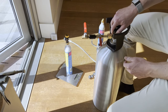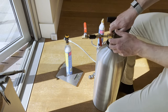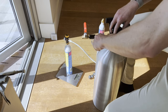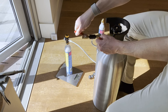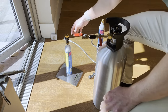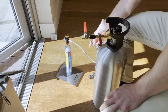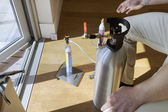To start the filling process we first need to vent any gas out of the hose. To do that, turn on the main line — no hissing, that's good — then just for a second open up the fill valve: one, two. Now close everything back up and vent it using the exhaust valve. We've vented that, so everything is out of the hose and we know we've got a good connection. We'll close the exhaust valve now — we're back at 929 grams — and we're ready to fill. Target is about 1329, which would be 400 grams.